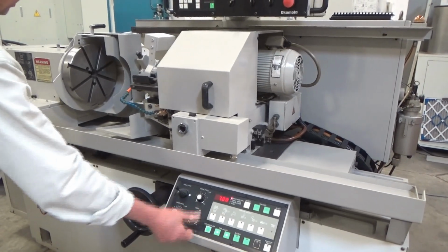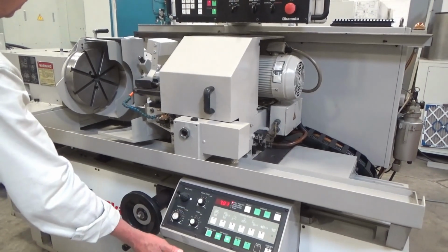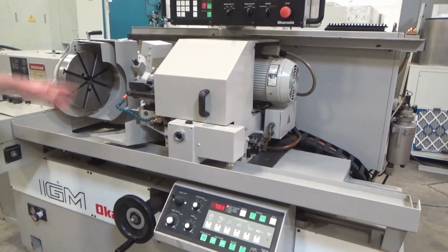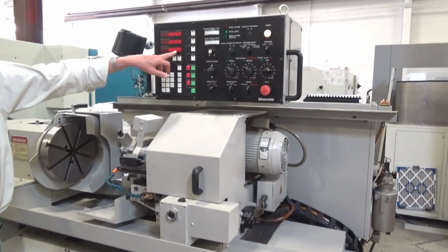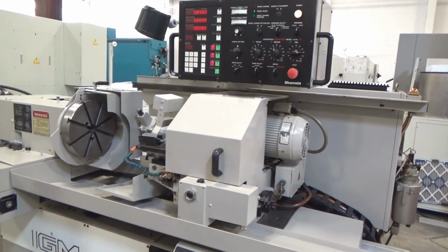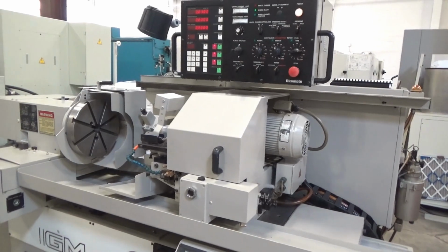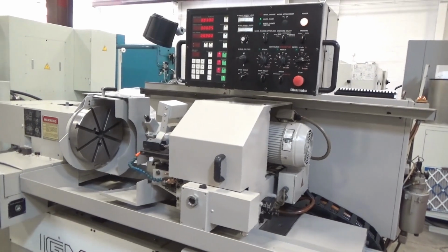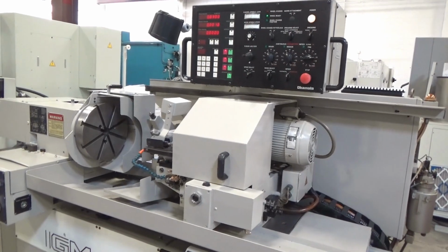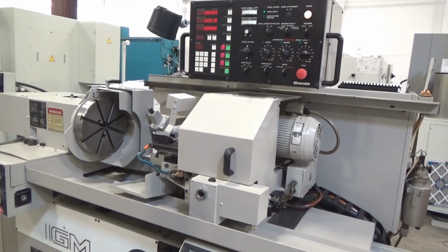See, you have that hesitation there. So I can move that farther back down. And right now also, I'm on 0, that's my start position, present position. If I just wanted to come in on that same part incrementally and take a couple of thousandths off, there's 5/10, 8, there's 1,000th. Well, let's say I'm done with that, I just took my 1,000th off.